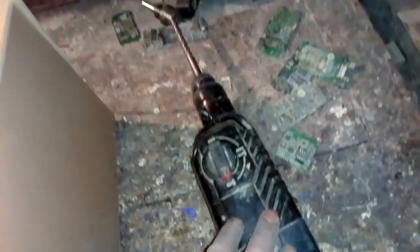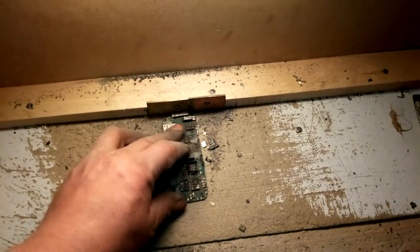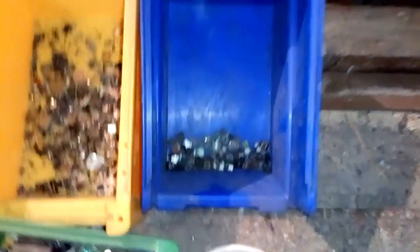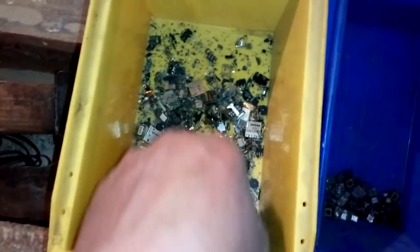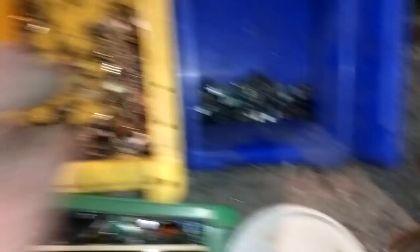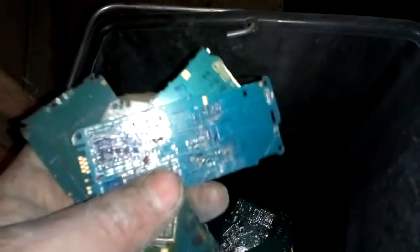I already started. A little update — I upgraded my depopulation desk with that lamp my customer sent me, thank you very much. What I do is depopulate with my electric hammer drill. I remove ICs and scrap metal, and the rest I call 'crumbs.' This is everything else except tantalum. Here I got clean board — it goes pretty fast, about 10 to 15 seconds per board.